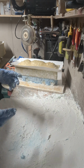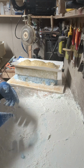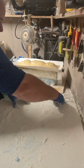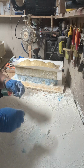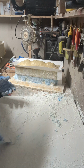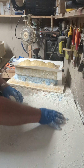But again, play around. Start with one tube and get used to the working time with it. If you grab it and you put it in a bowl, and that's the one thing that a lot of people have done, you see online, when you put it in a bowl, you can see what it's done to this trowel. You scrape it off afterwards, but it hardens up so fast, you don't want the bowl all hard in chunks, because first of all, you'll never mix it, and you get hardened little chunks in it, and it becomes a mess, and you waste a lot of it because it's sticking to the bowl. By doing it this way and scraping it off, this is the same way bakers work, they use those flat steel things to clean the grills off and stuff like that, the cooking surface, I mean. And they start with a clean surface like that, and you're wasting very little.